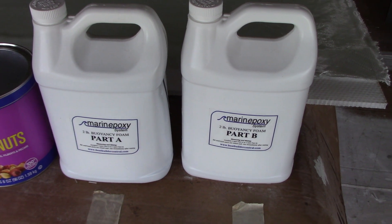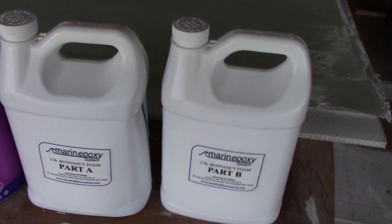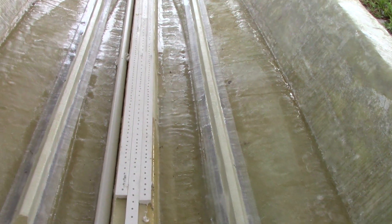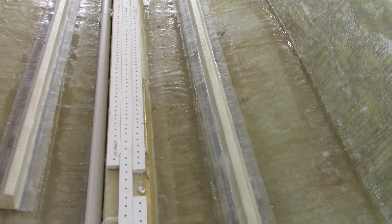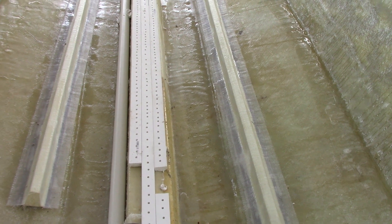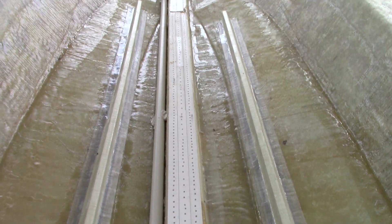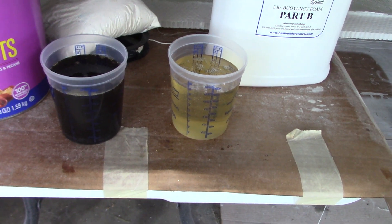Now I'm gonna test out this foam. It's two-pound buoyancy foam — a two-part epoxy deal for the boat. I've never worked with it before so I'm basically just gonna pour some along the sides of the middle stringer to see how big it actually gets, then go from there. I gotta get this foam in there to level everything so it can support the floor too because it gets pretty hard in the end. I've got the transom all ready for an engine and everything leveled off with the spacers.